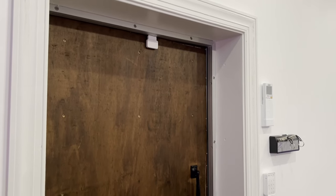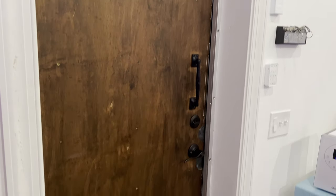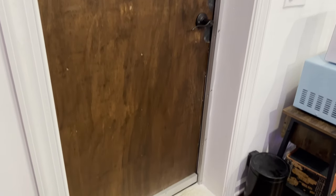If you have a different brand of perimeter seal or even a different one of their models, it should be a similar install. I also installed an automatic door bottom, which is a soundproof acoustic seal where when the door closes, the bottom drops down and seals the bottom of the door.